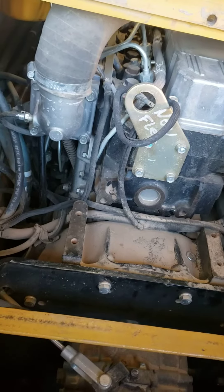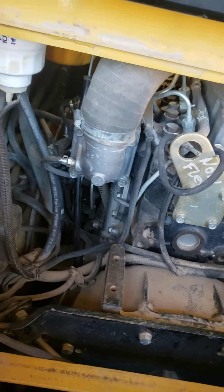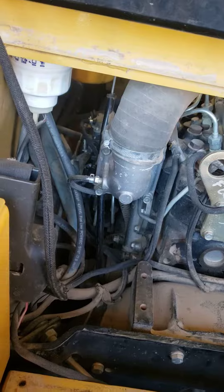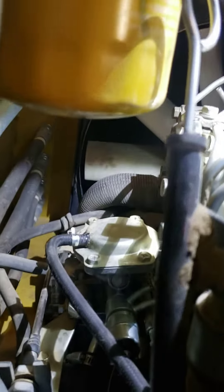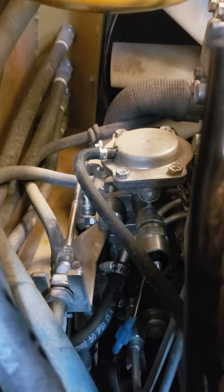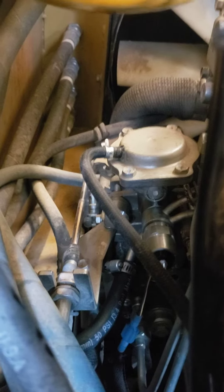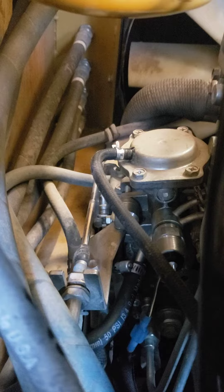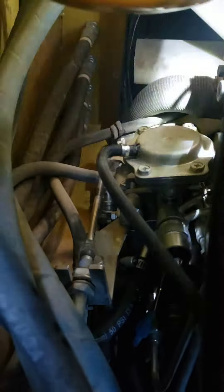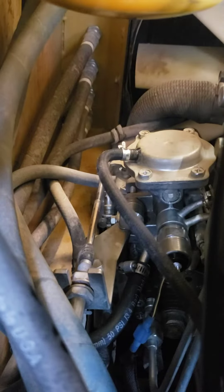The Sutter 500 with the Mitsubishi engine has a fuel shut down problem causing it not to shut down automatically when you turn the key off. That very top solenoid right there is the one we're going to be replacing. To get to it you're going to have to remove the seat and the engine back board screen. You can take the hood off, the air cleaner and the exhaust off, but it's going to be a pain to get to. With that being said, we can get to it here.